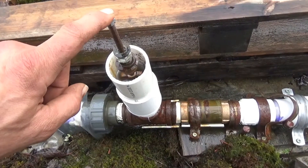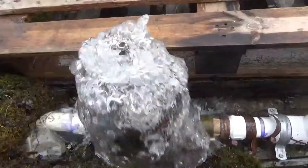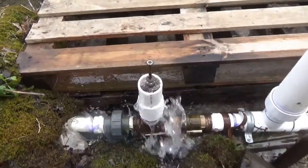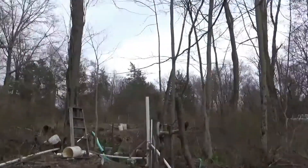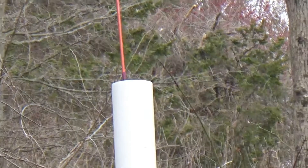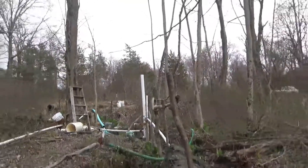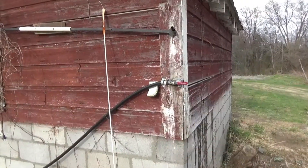You can see it's running pretty stable. I'll zoom in on the stand pipe and you can see that our marker is sitting at its normal height, so our supply is keeping up with this rate of flow. That's a good sign — we're not depleting our water supply to the point where we start taking on air bubbles. Now we'll go up top and do a flow test.